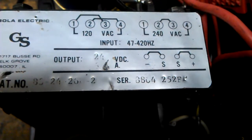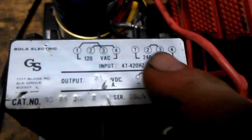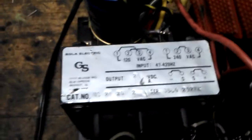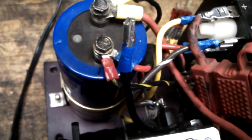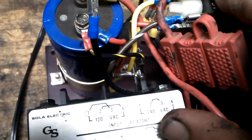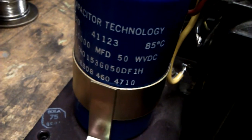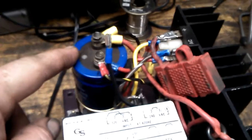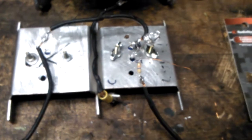Now about the power supply — this used to be an original solar unit, rated at 24 volts DC at 6 amps. The transformer itself has a center tap, and without the cap or rectifier hooked up I get about 60 volts out of it. Rectified and smoothed with a 15,000 microfarad 50 working volt DC capacitor, I can get about 75 to 100 volts out of it when I max it out on a variac — though I really shouldn't, as the cap probably won't take it eventually.